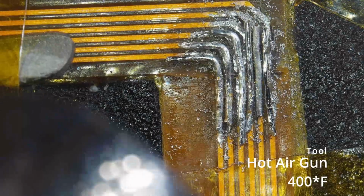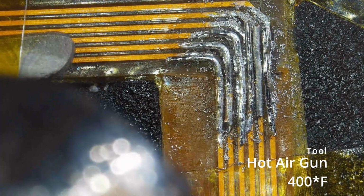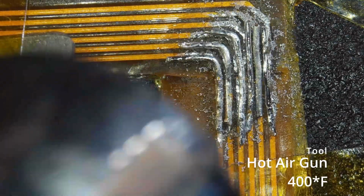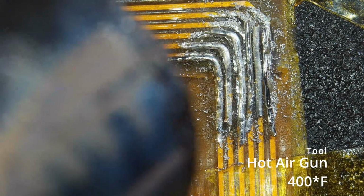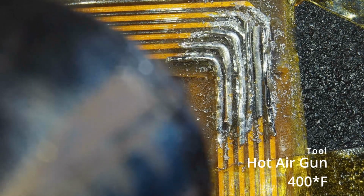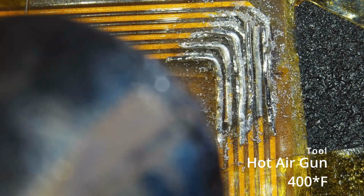So there you are. The bits are back in place, and I'm giving them a good dose of heat here to ensure that I'm melting all of that flux, that solder paste that's underneath the cables. So it takes me a good few tries, honestly. I had to bump up the temperature all the way up to 400 degrees, as opposed to my preferred 330 usually when I'm working with leaded components. So we are able to get this pretty well tacked down. Like, it honestly worked. But wait till you see later the magic that happens with the right flux. And that's always the key.